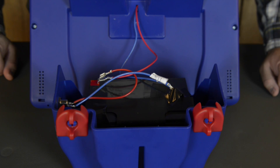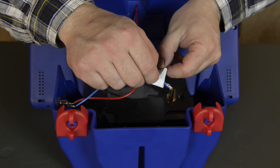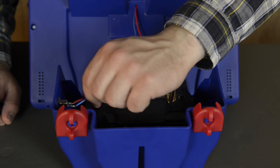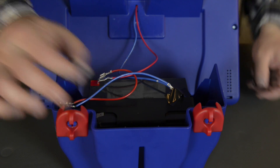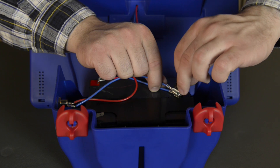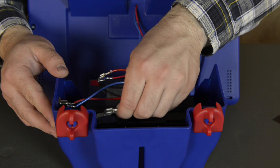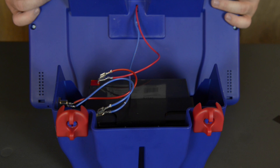To connect the battery to the energizer, remove the white label, take the electrical tape off the terminal, and remove the terminal cover. Remove the electrical tape from the negative battery leads and connect the battery to the leads, then close the energizer case.